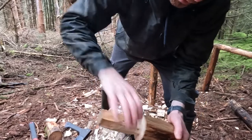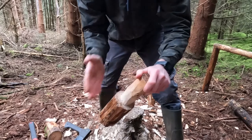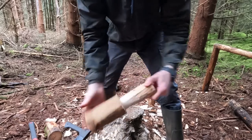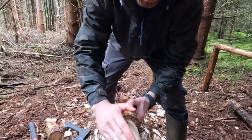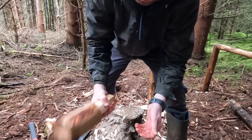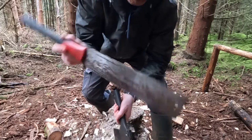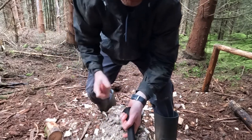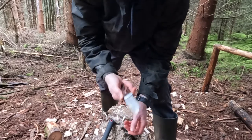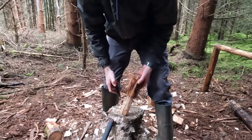As you go along, remember to take regular checks around to make sure you're going in evenly all the way around the mallet. I'm happy enough now with how far I'm in, so I'm just going to carve off the rest of this handle to about the same as the top here. The tools I'm using are a small hatchet and a pull saw, but you could accomplish the same thing with any sort of saw like a small folding saw, and a good knife. I'm using my small hatchet because it gives me a bit more weight behind it and makes the carving job a lot easier.